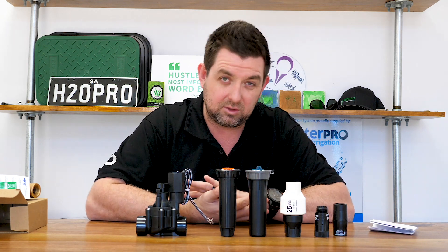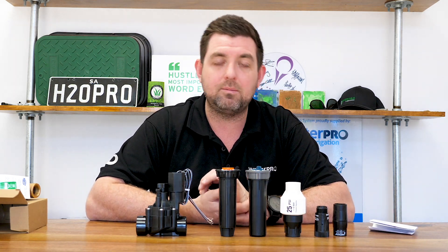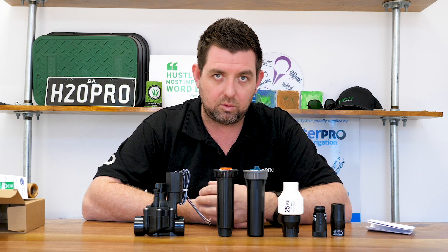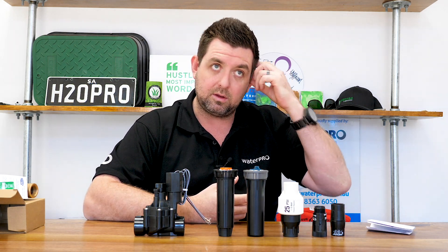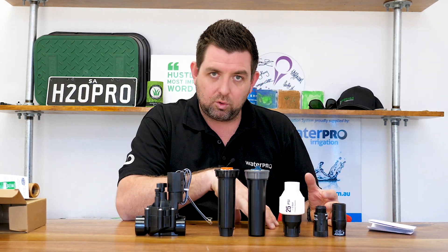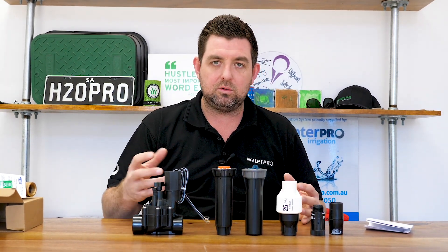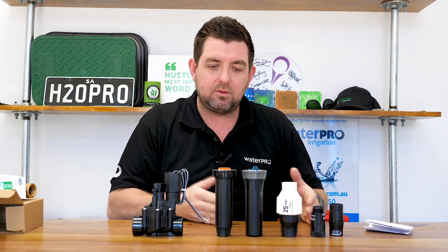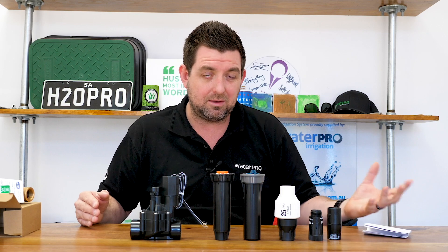There's a lot to this, but I really just wanted to make an educational video to highlight that pressure can be a concern. It's not always a concern, but it's something to approach your professional irrigation store about while looking at your system, to ensure you've taken the pressures into account and dealt with them appropriately. If you're not sure, you can get pressure gauges to test — most professional irrigation shops will have something you can borrow or hire. You screw the pressure gauge onto your tap, test your flow at a certain pressure, and then you'll know how it's all going to work. If you've got issues like sprinklers misting, fittings blowing off, or drippers not dripping or dripping more than they should — look at your pressure.